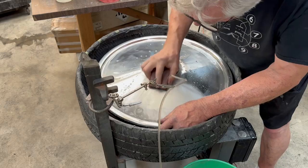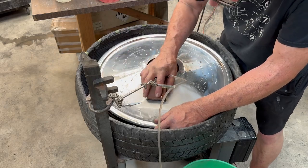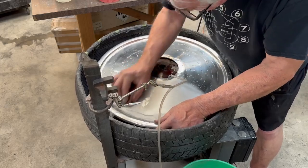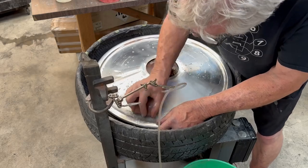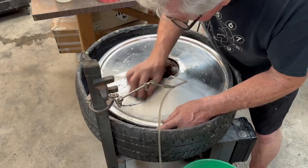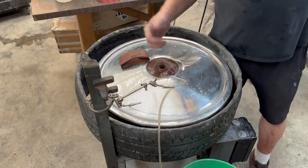This also aids in the blocking of this vaulted area that we had to sand out — are you kidding me? — with 60 grit. Yes. But now by going through progressive papers, we have gotten it down to a point where I can knock out these final radial sand scratches right up to the outer lip here with 320. Then we'll do a radial on the machine with 400 and go to the buffer.